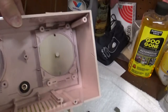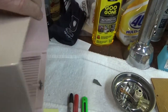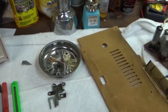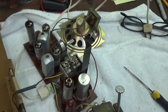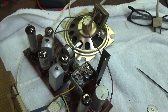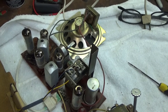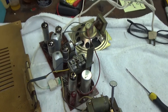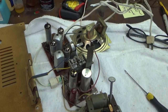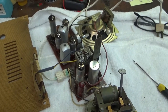There's the real pink color on the inside - it's not faded out. The only thing wrong with it is one of the tubes had just fallen out. So I popped it back in and the radio came up and ran just fine. It tunes really well. No hum from bad filter capacitors.